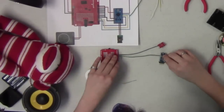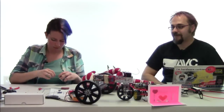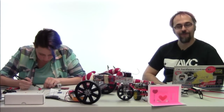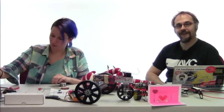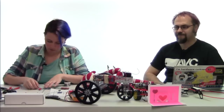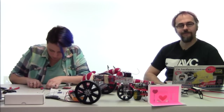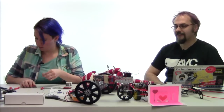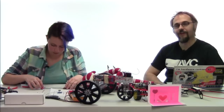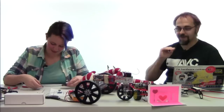So we've had a question, somebody asking how long it'll run on one AAA battery. It actually won't run on one AAA battery unless you use some sort of a step-up voltage supply, and I would guess at that point that it's not going to run terribly long on one AAA. You're going to want to use at least, I would say, 3 AAAs or 3 AA batteries, but I would guess that on 3 AAs or even 3 AAAs, you're looking at several hours. I mean, you take this puppy out to the bars one evening and you are good to go.